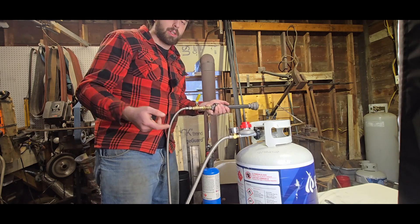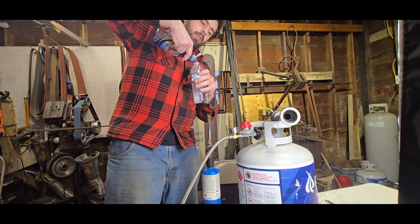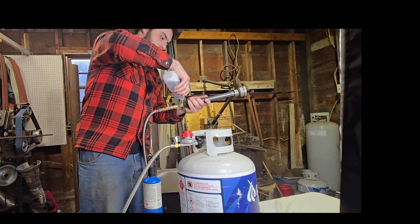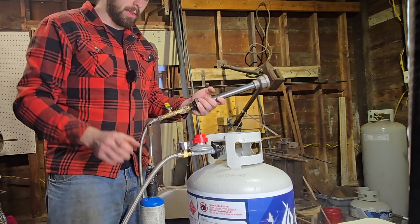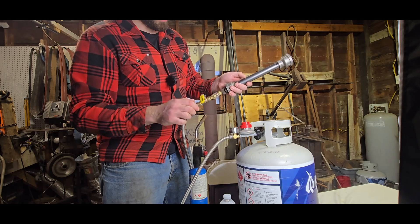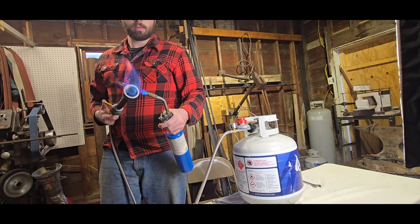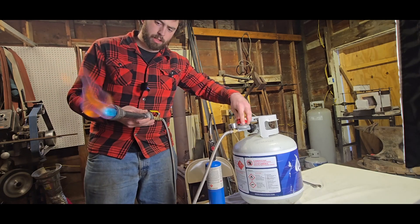To test the joints of your new gas burner assembly, I recommend using a bubble tester. I didn't have a spray bottle so I'll show you a makeshift version: get an empty water bottle, fill it with warm water, add a decent amount of soap so it's fairly concentrated, put the cap on and give it a little mix. Take a nail and poke a hole in the center of the cap. Apply it to your joints — if you see bubbles, the joint is leaking and needs to be tightened. After tightening, apply the solution again to confirm no leaks.